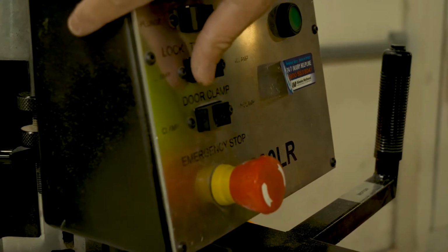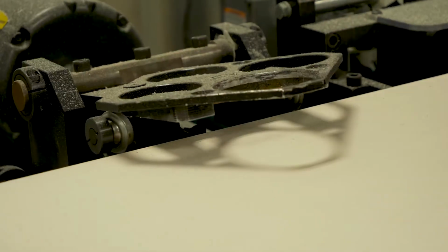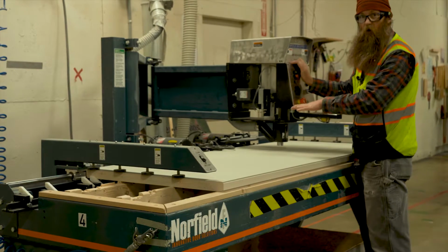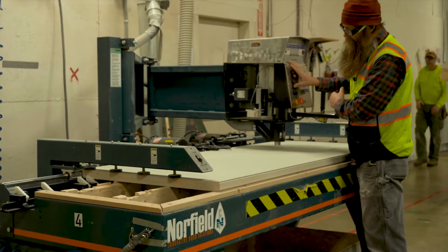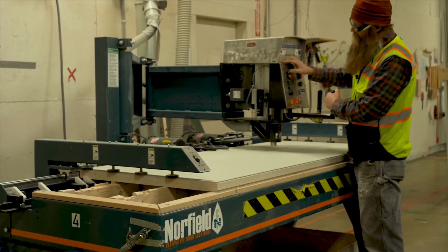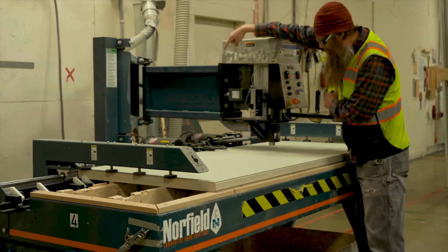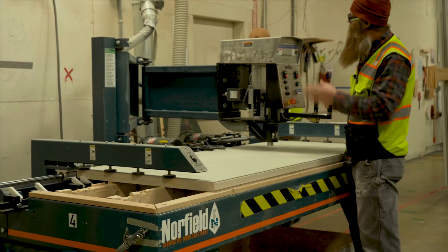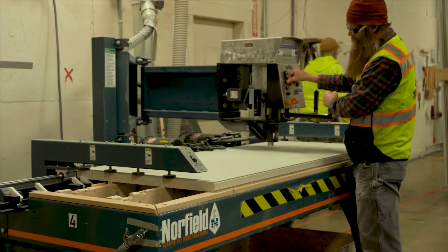and this button here is for the lock template, which is this. Push it down to there and it will lower it down, and then you push it again to clamp it all the way. This is the latch drill, which is back in here. So you turn that on, and once you make sure everything is all clamped and the suction's off, you just do the latch drill.